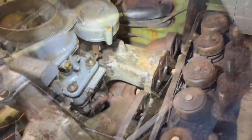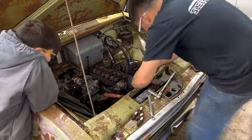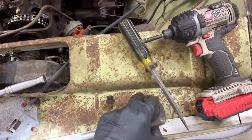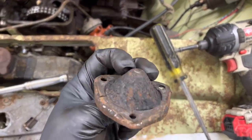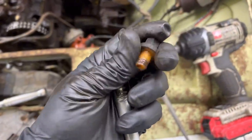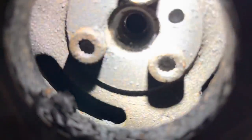Let's see what our ports look like. That one there's not looking too healthy, but it's better than the Galaxy Wagon did. This is kind of interesting — I guess you call it the cam plate. It's just like this pointy little cone that stops the cam from coming out. And look at this — this bolt in the end of it is plastic, and that's what rubs against that cam cover. And the end of the cam has these crazy 12-pointed Torx — I can't remember the name of them.